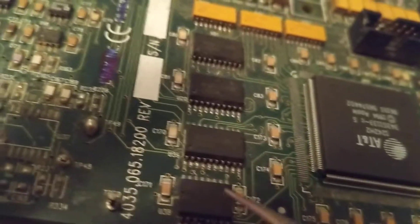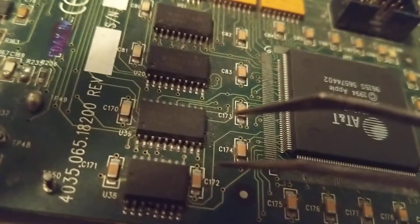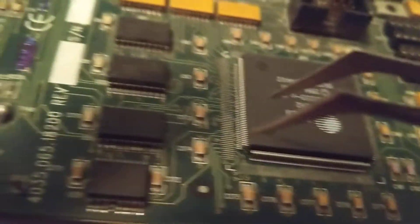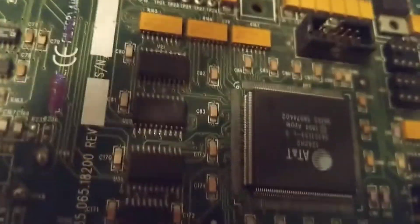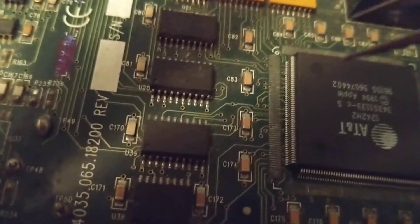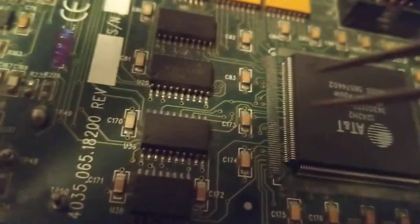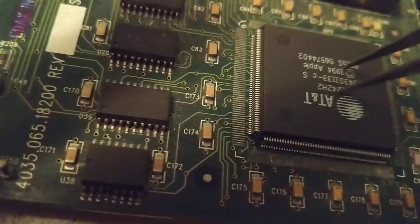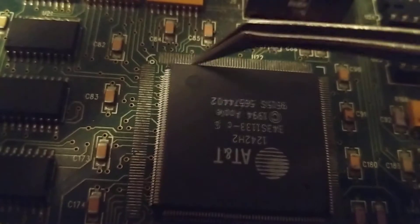Sometimes the break is between inner layers — between the top and the bottom — and you cannot do anything about that; you have to scrap the board, as unfortunate as that is. The break can also be where the pins pop up from the pads. The video I made yesterday about the printed circuit board got very good views — I was surprised, honestly. If you want to see me solder and unsolder these components, leave a comment — I'll show you how, as long as there's interest.